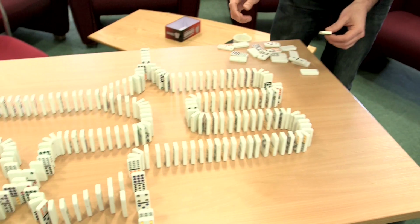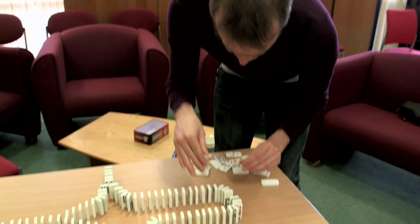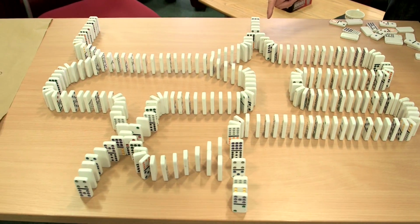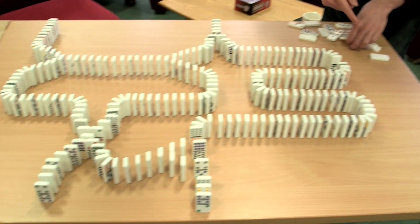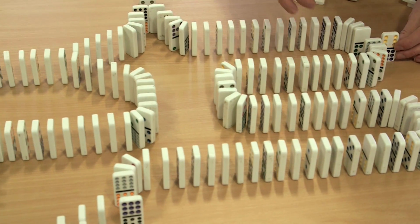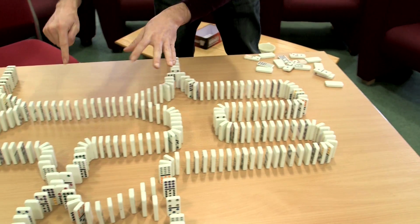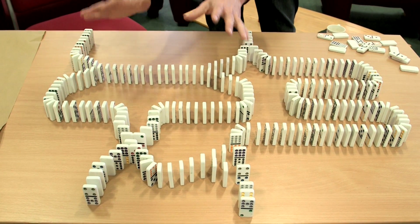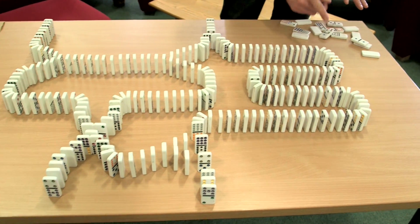All right, so I'm almost finished. I'm putting the last 2 dominoes in over here. That's a monster, man. Well, this bit's interesting because this chain splits off, and all it does is zigzag backwards and forwards for a while. And the reason I had to do all these extra dominoes is because this is a delay line. Because you can still see the exclusive OR is in here, I need to give the exclusive OR enough time to do its thing before this signal catches up with it. So this is just delaying one of the signals.